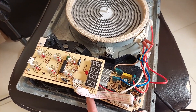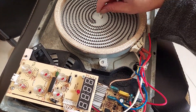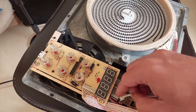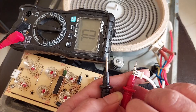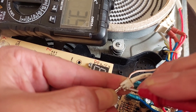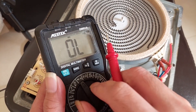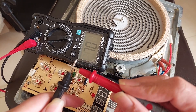Before we test all the components, we need to test this middle sensor — sometimes it's covered with corrosion. You need to clean this; you can watch my other video about this thermal sensor. I want to make sure it is still good. I'm going to test it with my multimeter using the resistance tester — ohm. We can test these two pins; it is showing 3.5 ohm, so it is still good. Make sure you have connection from here to these two pins with the continuity test. This is the diode and continuity test symbol — when there is a connection it will be beeping.